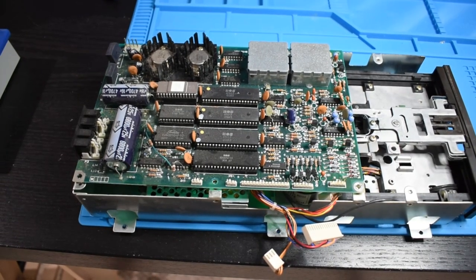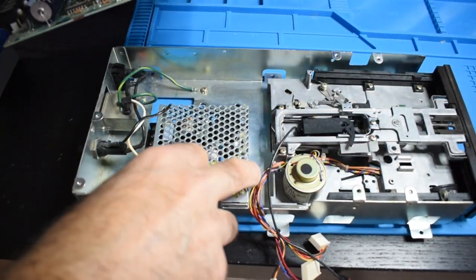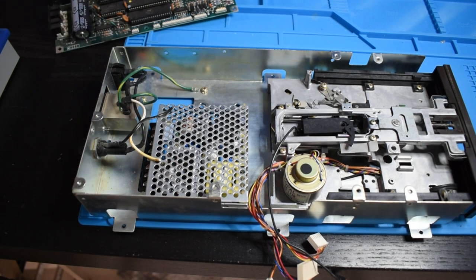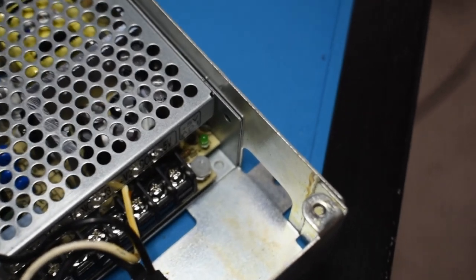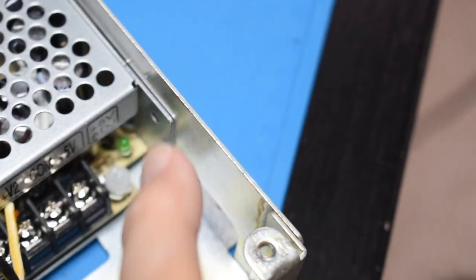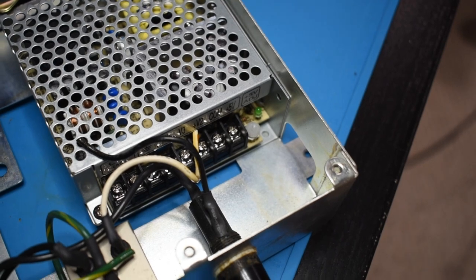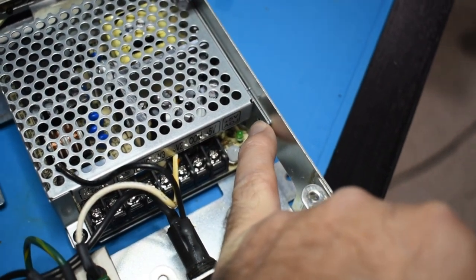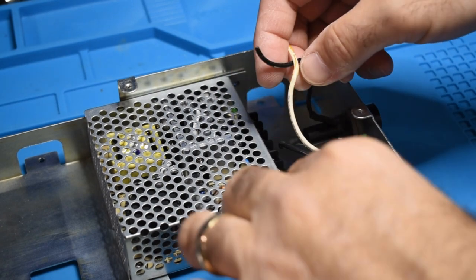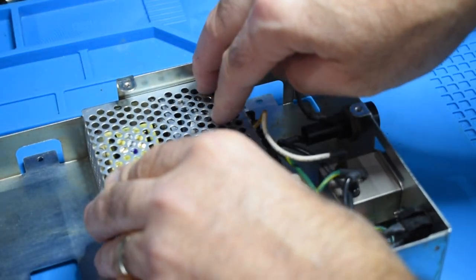This is largely how everything is going to mount — all these connectors will plug in here, so mounting that power supply in this area would be pretty good. This power supply doesn't have holes that line up conveniently so I'm going to have to drill a hole. I'm going to put two screws — one on the bottom and one against the sidewall — and bolt it in so it's got a nice solid connection and won't bounce around. I'll go ahead and get the wires connected first since it's a tight fit, get the ends on there and screwed in, then bolt the power supply in place.